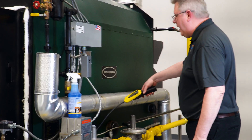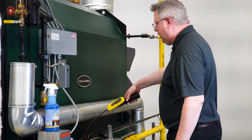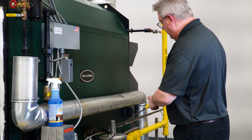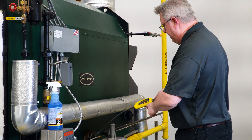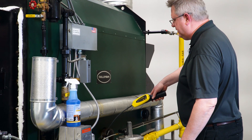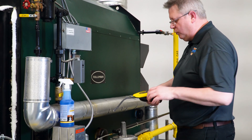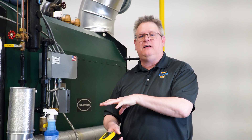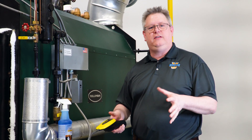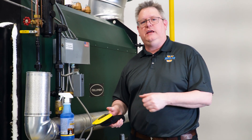We don't want to forget the pilot line. And here we are — it looks like we've got a leak in this vicinity. This is where sweep detecting gets a little less useful, because while it can pick up a gas leak at very sensitive levels, it's not always as good at zeroing in on the exact leak location.